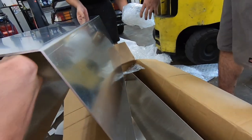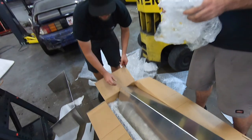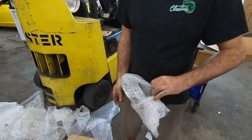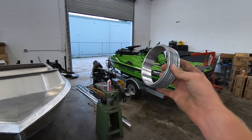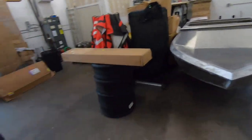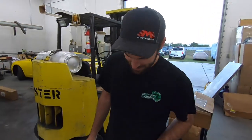Yeah, exactly. So this stuff is two fuel tanks, and you can stick the factory fuel system top that's on these tanks right in. They have an entire adapter system so that you can run the fuel hat and everything out of what we have. Oh, that's the adapter ring right there. So that would be the fuel pump adapter ring, as they call it, which just makes it nice because it saves you a lot of time. You can reuse the equipment that comes in your jet ski and build your own tanks. These are a little bit bigger tanks than what would be in those RXT-X 300s because if we're going to ride these things way up the river, they're 300 horsepower, they're going to need a lot of fuel. Especially when mine's tuned on E85. Mine's tuned on the hot gas with nitrous. It's going to need some capacity. James is going to have methanol. Makes it 6 miles. All right.